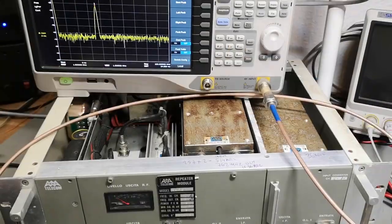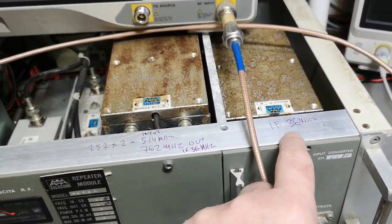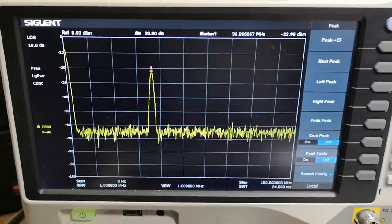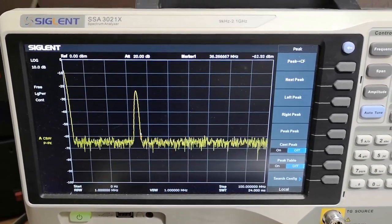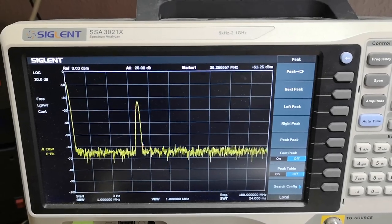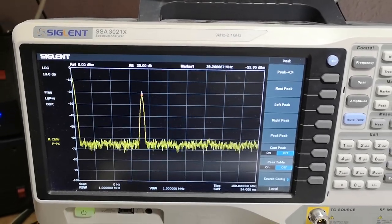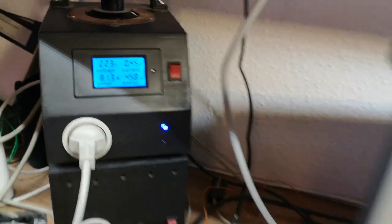Before going inside the modules, one more measurement: the IF is 36 MHz. Looking at the IF output of the first converter, it's right at 36 MHz. Stepping the input frequency by 1 MHz moves it, and stepping further puts it outside the passband — gone. Very sharp filter on the IF converter, which is exactly what's needed for a channelizer to work.